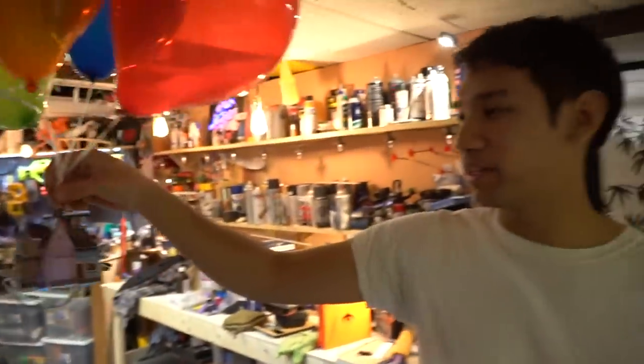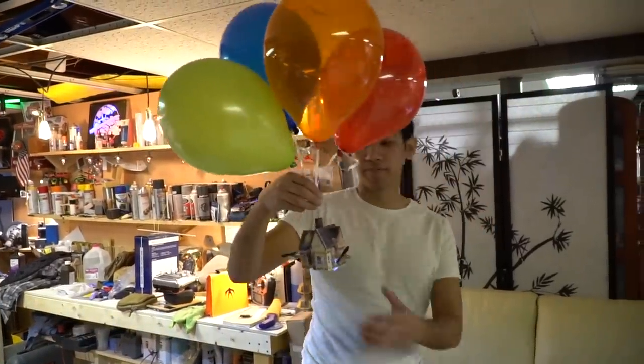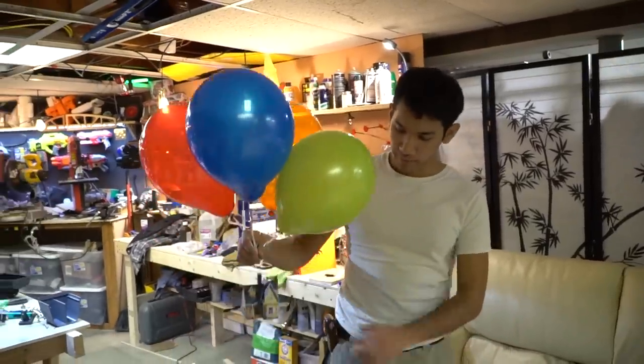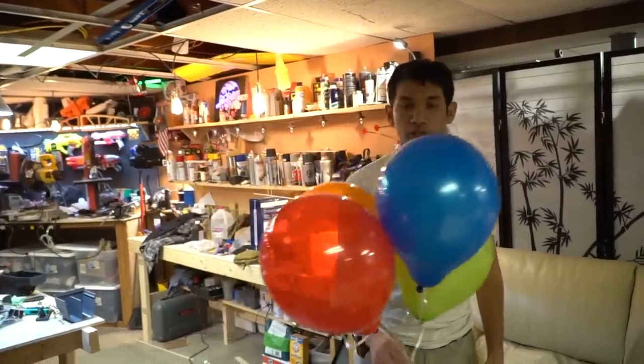Okay, that's pretty much it for the simple how-to-build-it portion. Like I said, if you're having problems, make sure to check your gyro direction and also that you have enough weight so it's sinking at the right velocity if it's too hard to steer. Make sure the motors are canted up, like I said earlier, and then some. It works pretty well once you get it dialed in.